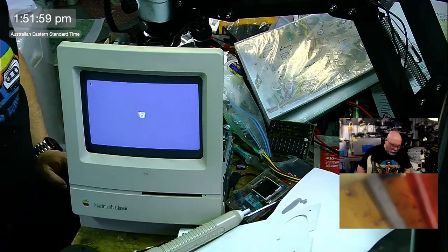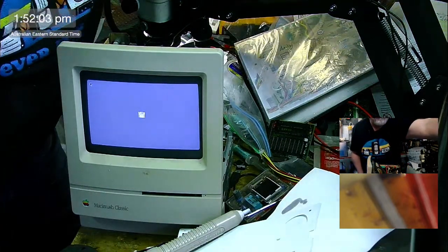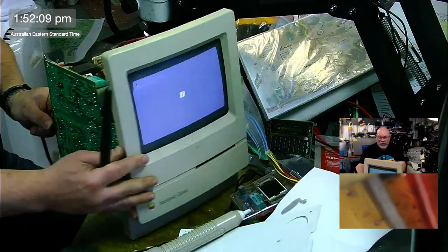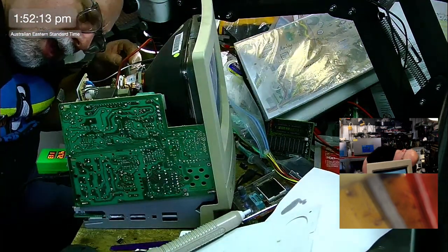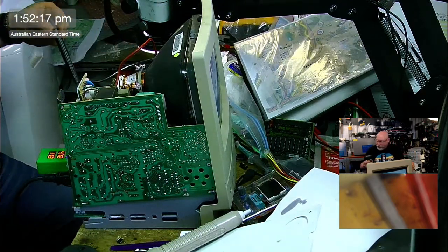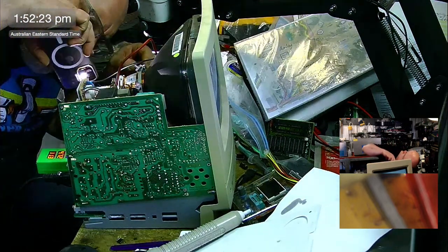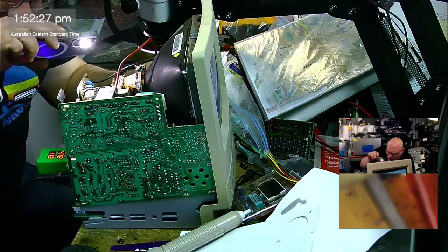Right, so we're getting 4.72 and 11.3 volts. So I'm going to make a slight adjustment to the voltage using my special voltage adjustment tool. Super long, so that I can get it through here without putting my hands in high voltage danger. Danger, danger. High voltage. It's a really dumb position of this thing too, by the way.